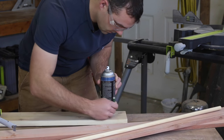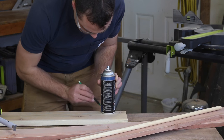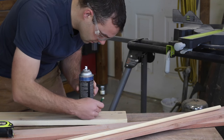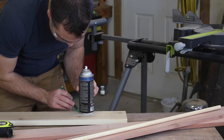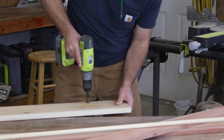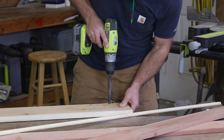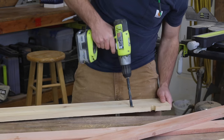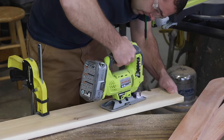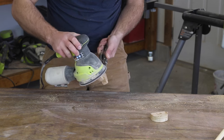Create baskets for the bottom part of the ski poles using some scrap wood. Use a spray can to create the rounded part of the basket — you'll want one side of the ski pole basket to be flat so it sits flush against the ski. Then drill a hole in each basket for the half inch wooden dowel pole to go through. One of the holes will be right on the edge for the pole that rests flat on the ski, and the other hole will be more towards the middle. Cut out each ski pole basket with a jigsaw, then round over and smooth out the pieces with a sander.